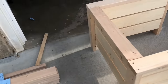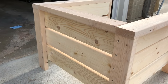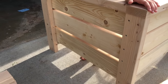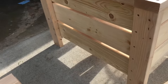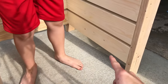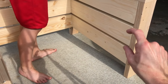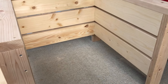We have our cap on the back — this is what the back's gonna look like once that's on there. Take care to make sure this board is flush with the top of this board. The back's all put together, screws through the sides all the way down. Now we're going to do the front, which is going to be a 25 inch 2x6 across here, and then a 25 inch 2x4 above it right here. We'll stop again when we're done with that and recap.